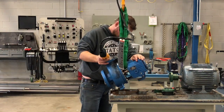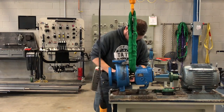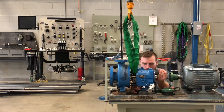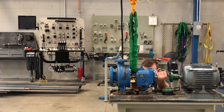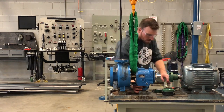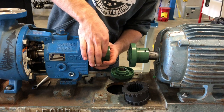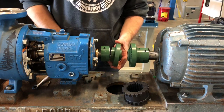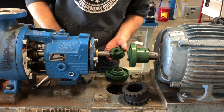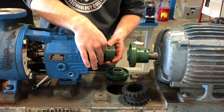I'm now reinstalling this pump onto the skid. The big difference between this and real life out in the field is there are no pipes hooked up to that volute, so it's pretty easy just to go set it down on the base. Typically you'd have to weasel it into a tight spot with seals in between, so just be ready for that. I go ahead and put in the bolts, and now all we have left to do is put that coupler back on. When putting the coupler back on, make sure you don't have any burrs holding it up. Make sure you slide in the keyway at the same time — it seems to be easier that way. I actually put it on the first time without the bolts and figured out there's no way to get the bolts in after, so make sure you do that first.